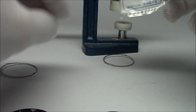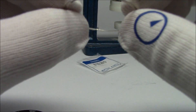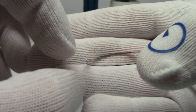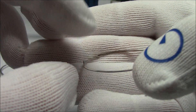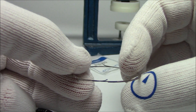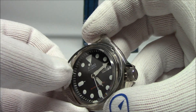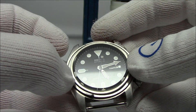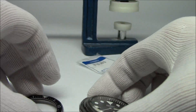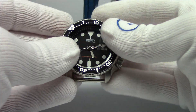I have here a new spring available from Seiko USA — this is for the SKX007, 173, 175, all the same watch. It's got the two vertical tabs and the two leaf springs. To repair the watch, you simply lay the new spring in, put the little feet into the holes on the case, take the bezel and place it on top.